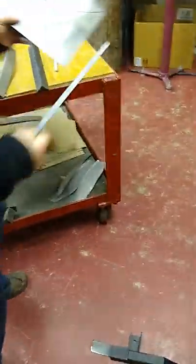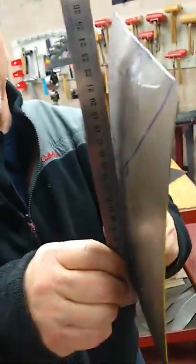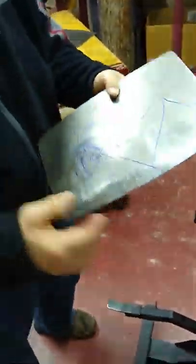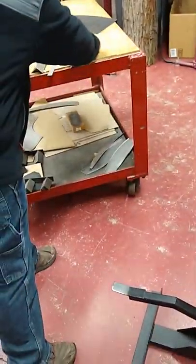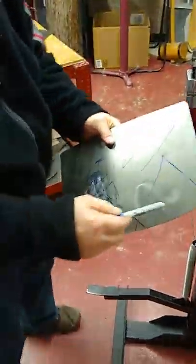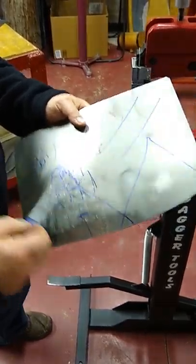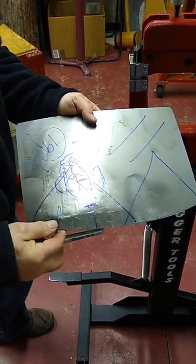We can quickly see how much shape we added to that flat sheet and how much it changed in two directions — and that's with very light force. Depending on the shape and where we want to go with the surface, we would interlock another pass. We could come back and put another one here, another one there, and continue to work that surface depending on how much shape we need.